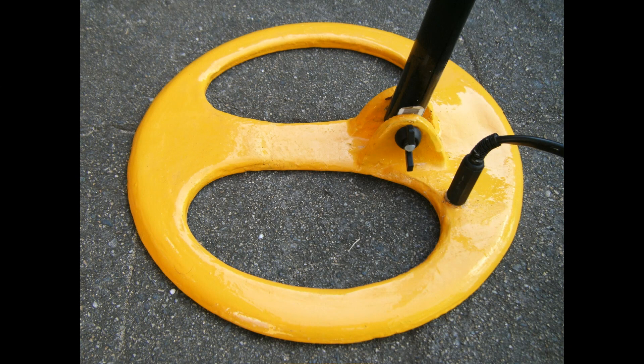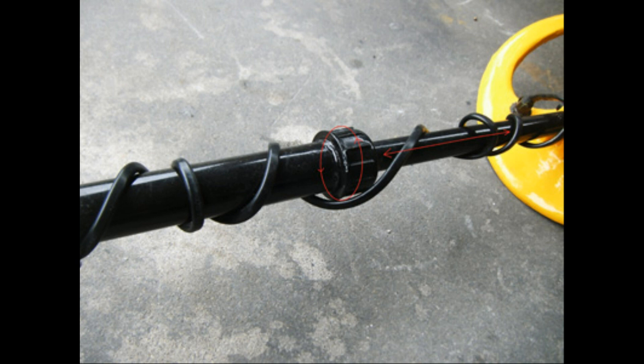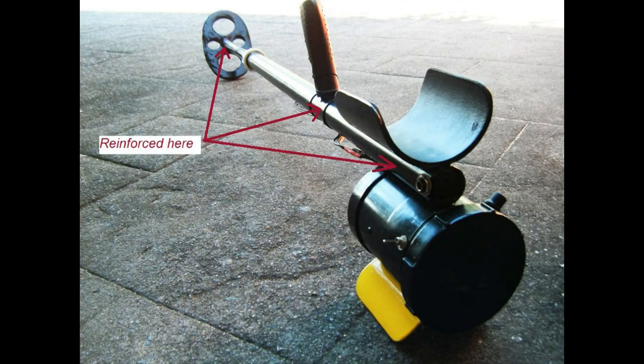The adjustable shaft must be impervious to weather and not made of metal, at least not the tube which connects the search coil, as it is too close and will interfere. You should be able to slide the tube inside another shaft without side-to-side slop and be able to adjust and lock it into position. It must also be very light and may need to be reinforced in some places, and it must also be paintable.